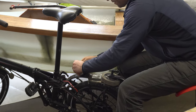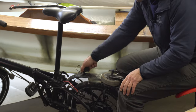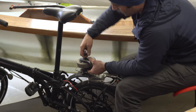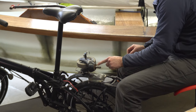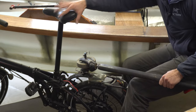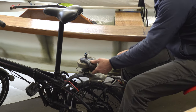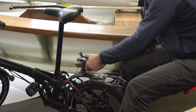And you can see how tight the pin is, which is something that I actually want, because that means that there's no slop there. The caster's pin then drops in and goes all the way. Can't come out because it's got a ball end. And then here's how the system works. There's a titanium bolt going through some bearings there that allows the tow bar to rotate, because when I bicycle, I'm leaning a little bit to the side with each pedal stroke. Then for your typical turns, that pin provides that axis of rotation. And then for coming down a curb and up the other side, that pin allows for that axis of rotation.